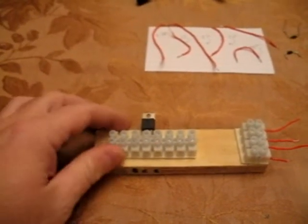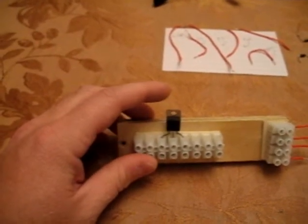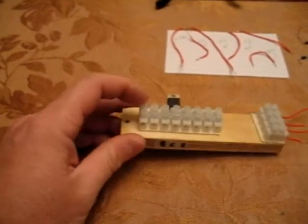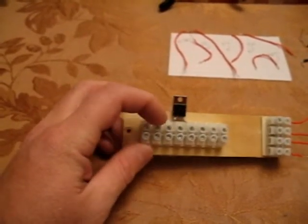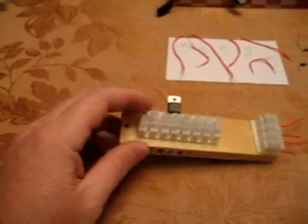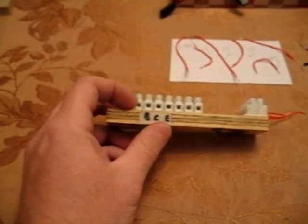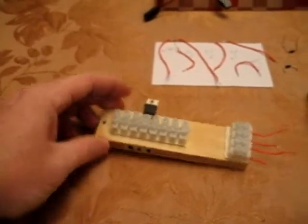After that's done, we're going to bend our transistor, the TIP3055, so they'll go into the respective holes, and start by putting the base in this junction point, 2 from the left. And when that's done, you can put a piece of tape or mark your junction point as base, collector, and emitter. And that will be our building block for building the circuit.